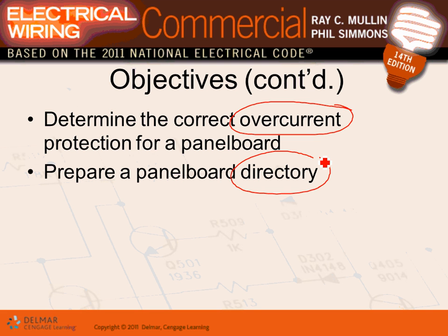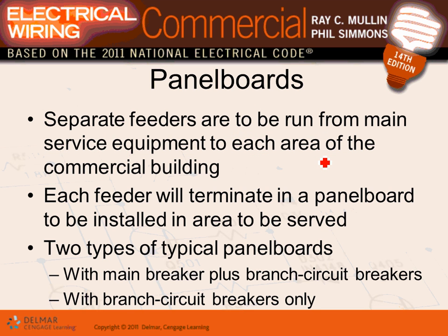A schedule will assign a physical location to every circuit breaker in your panel, meaning you go to circuit number one, and it will say Chad Curtis bedroom, feeding lighting in Chad Curtis bedroom, or room lighting or receptacle or both in room 111. That's coming, Adam. You guys are going to be building it. It's already built. You will massage it to run this schedule. That's your directory required by code. So if you get into a panel and you look at the circuit breakers, and there's no directory to identify what they are doing, this is a violation of the code, but most of them are grandfathered in anyway.